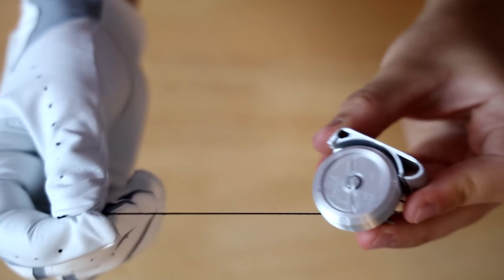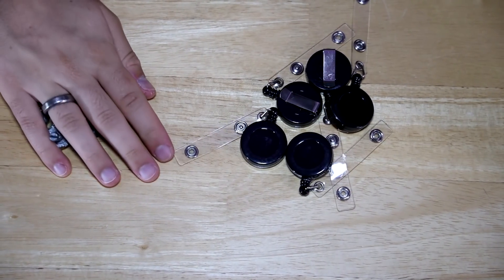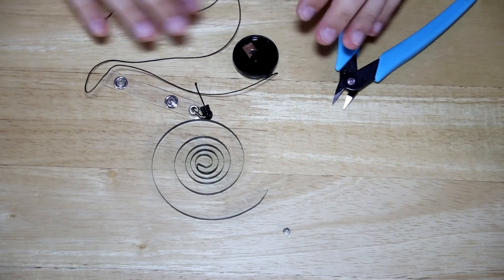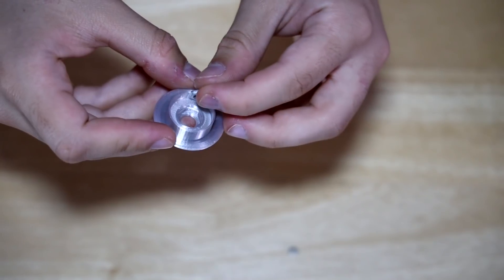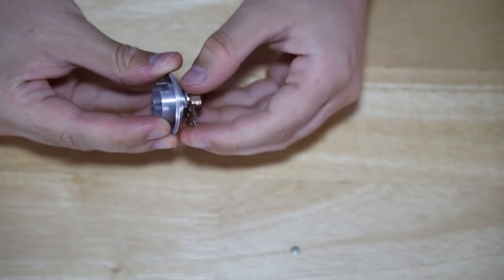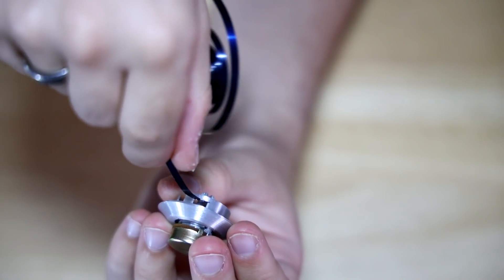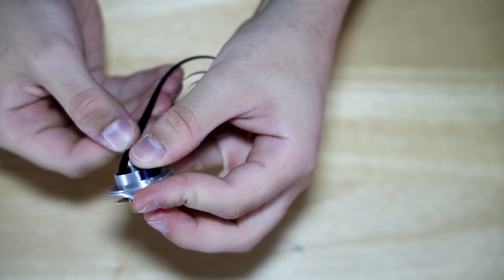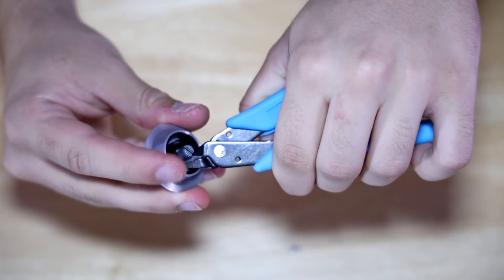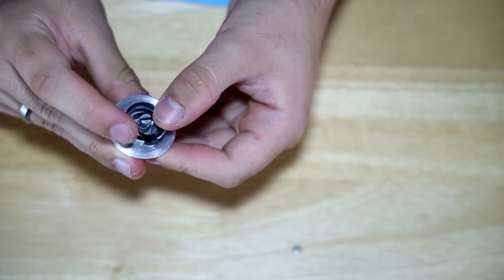Alright let's start building the reels — this part translates the movement of the string from our fingers into rotation of the potentiometer. First get your badge reels, potentiometers, and the nuts that came with them. Crack open the badge reels and take out the spring and string inside. Take the 3D printed tensioner and fit the nut into the hexagon-shaped hole, then screw in a potentiometer underneath and get it nice and tight. Fit the spring into the hole, rotate it 90 degrees, start coiling it, then fit the spring end into the slit on the potentiometer shaft. You should now have a spring-loaded potentiometer that springs back when you rotate and release it.